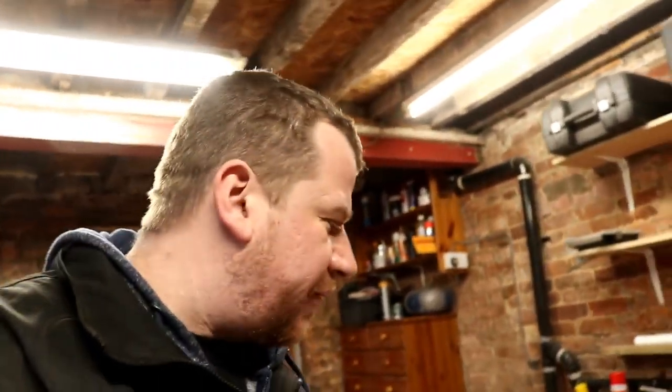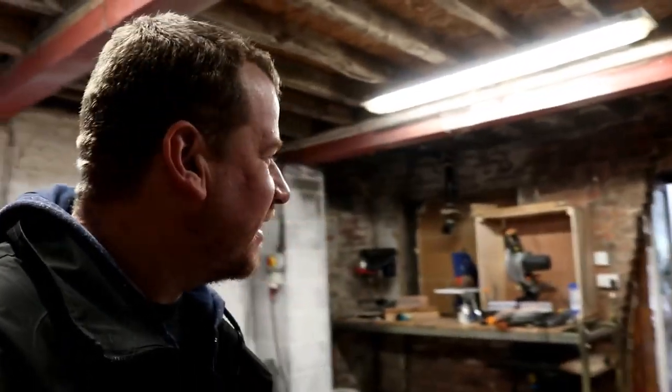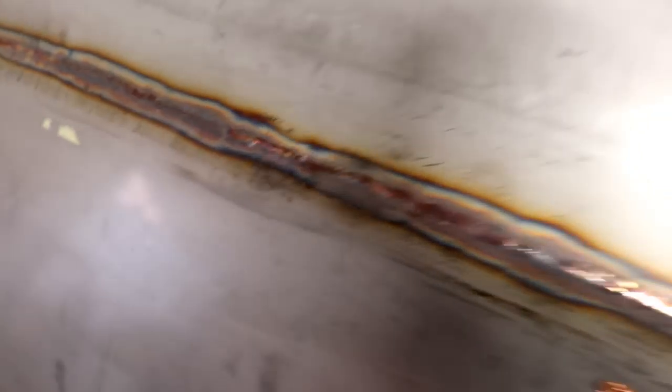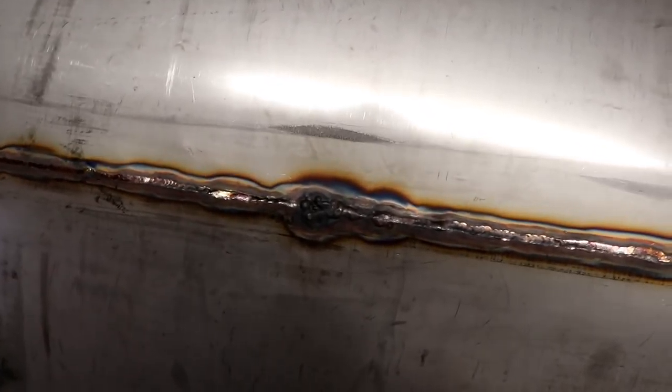They're in my papers this week, I think. So I'm literally down onto the last sort of 200 psi of argon. So I'm going to bring another tank in, I'm going to start to re-flow the back of it, just like I have done, until this is empty. And then once that's a goner — I've already rang them up, they've got two in stock, I can go and exchange today. Things are going well, I'm really pleased. It's an amazing Monday. This was the worst one the day before — the one with the big blowout — and I managed to re-flow it all. I am so bloody impressed. I think I've got the settings bang on. One pulse per second is perfect. It just allows me to move forward just in time and make the weld look like little coins stacked on the side. So what I'm going to do now is get the grinder out, I'm going to remove this part, and then I'm going to re-weld it before the argon goes. I've got a tiny bit left, maybe 100 psi.